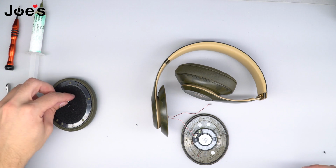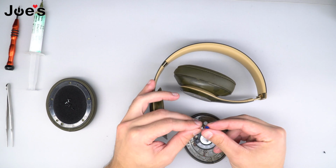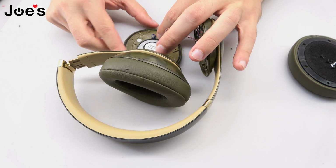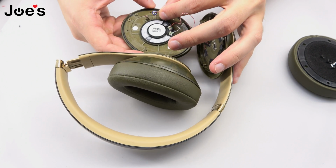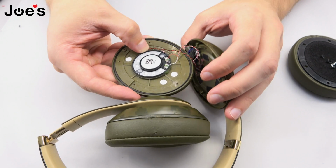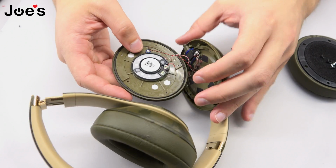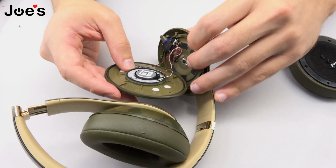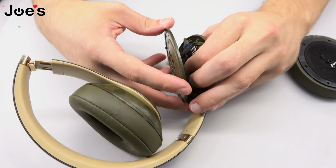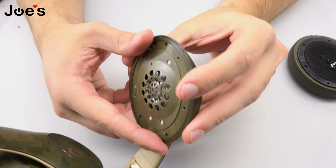Once the wires are soldered, we're going to go ahead and take this blue little rubber gasket, place it on the end of the mic bit, and we are going to pop it back into place, into the little opening. Once that is complete, we're going to go ahead and just tuck these wires into the center, and we're gonna close the speaker cup and the speaker housing together.